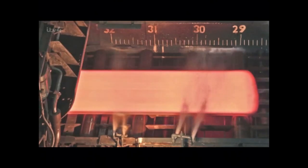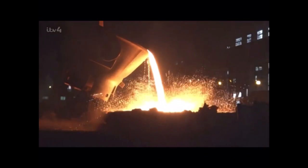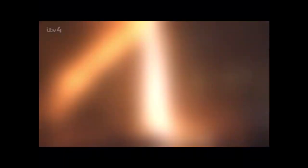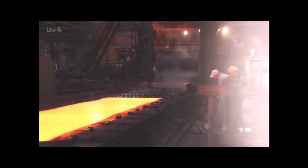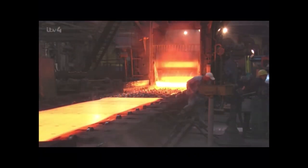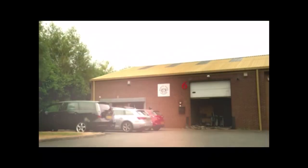They're made in steel mills like this one, from 80% recycled material. The iron is heated to over 1,200 degrees and passed through sets of mammoth rollers. The rollers squeeze the red-hot iron to the correct thickness — in this case 4mm — before it's cut into the required shapes and sizes and shipped to factories up and down the country, including Neil back at Netherton.